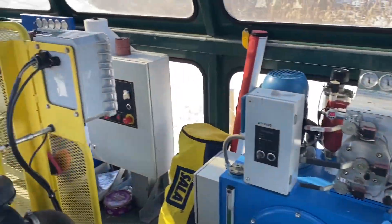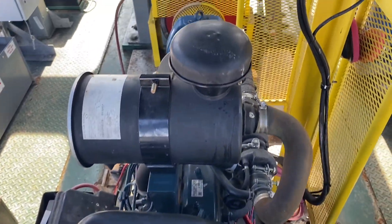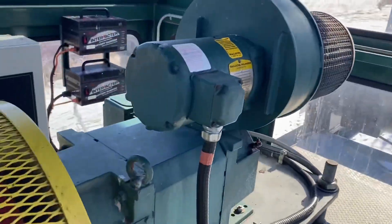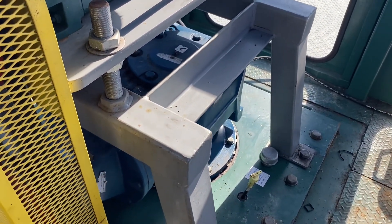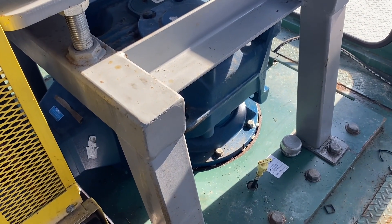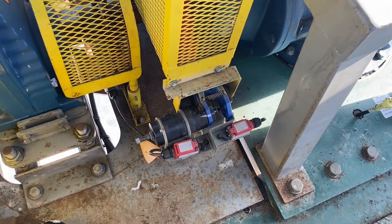So we'll just carry on here. Okay, so here we are up in the motor room — 2012 Doppelmayr fixed-grip quad. So your tensioning unit here, Kubota evac motor, brake controller over here, primary mover, little AC unit, fuel storage, battery backups. And then the gearbox here, which is kind of neat. You've got a little gearbox up top which then feeds into a planetary that the bullwheel's mounted on. Seems to work well — just the cutest little service brake you ever saw.